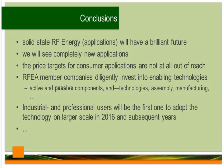That's a good question. I would think if you look at current PAs, they're mostly built from milled aluminum boxes, so this can actually be pretty heavy, even though it's aluminum. I have seen technologies that will make the aluminum boxes all but vanish, and that will then also be very light. So in the end, I believe there might be a slight advantage to the magnetron, although if you count in the transformer of the magnetron, it's already losing hands down against solid state, because the transformers, at least the ones that I carried around here a couple of times, are pretty heavy things, and solid state is not like that, certainly not in the next generation. It will be pretty light things.